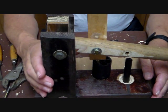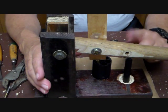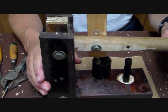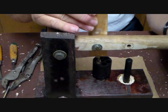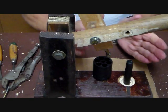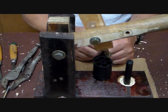What we have found in our present work is that our spindle, just like this one, was canted a little bit. In this case, the spindle was a little too far over to the left, but the cylinder is in the right place and it lines up well with the plunger. So what I have to do now is to actually straighten up the spindle so that it will be more nearly vertical. That I can do by re-drilling the hole and then epoxying the spindle in straight.